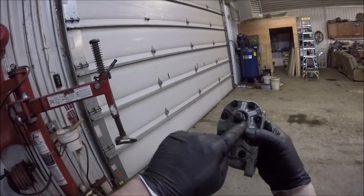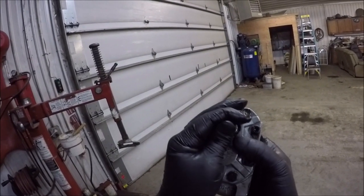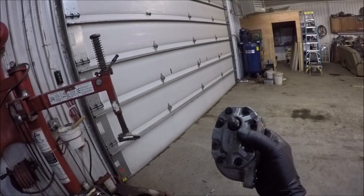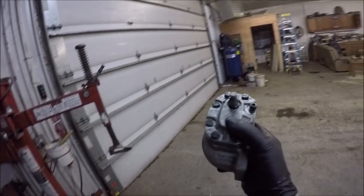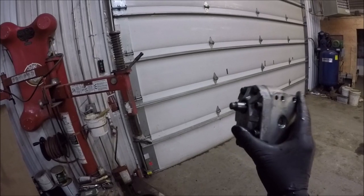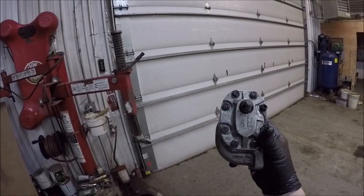Because this seal, with some wear in the bushings and shaft, is just gone — sucks air, hard to prime. If you farm flat ground, you might overfill it a little bit and limp by for a long time. But that seems to be the issue right here. Thanks for watching.